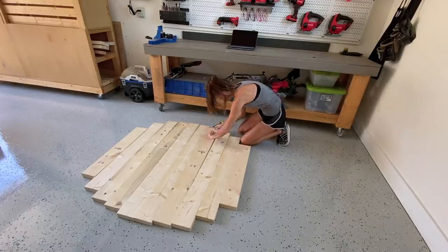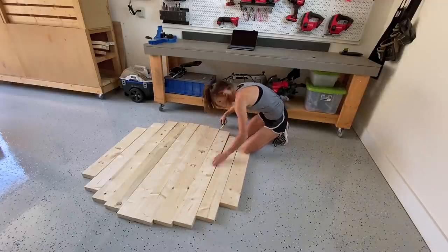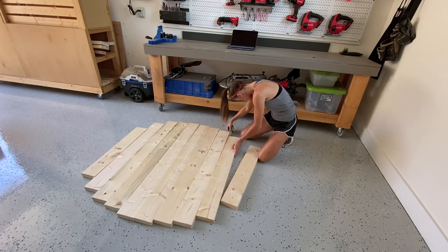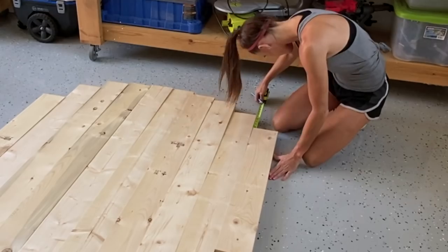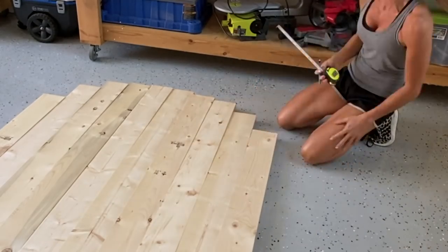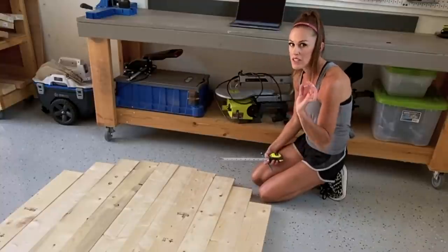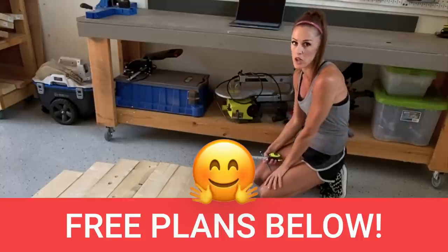Okay, so now I'm just going back and making sure that all of my boards are exactly even for each other. So the middle two are gonna be flush with each other, and then the next one's gonna be an inch shorter on both ends. That way it's nice and center when I cut my circle. And you don't have to remember all of that because it's on the free printable plans, and they are linked in the description box below.